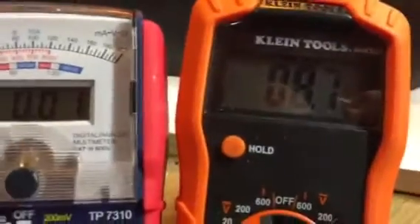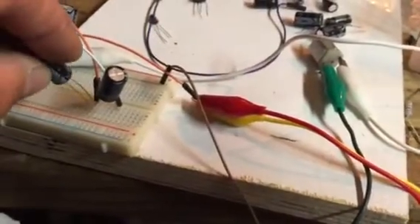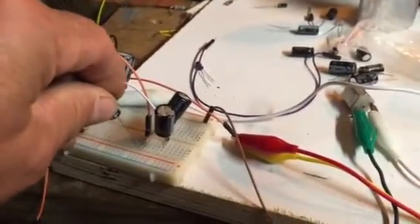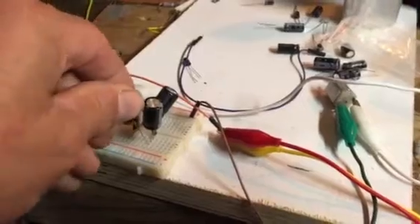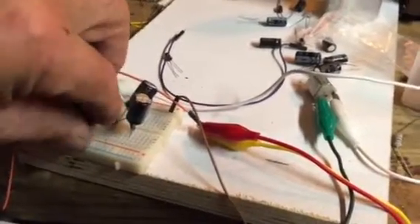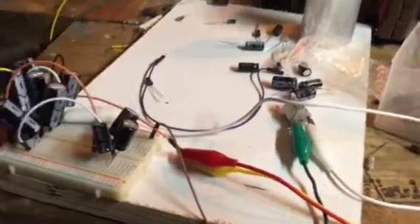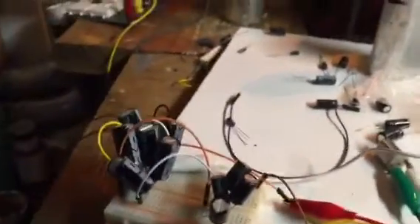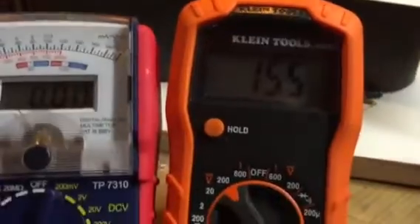You can see that the volts are not climbing as fast as they were because we're adding more capacitors. The next video we're going to use a transformer and step the voltage up — by doing that we'll probably learn that we get to increase the time it takes to charge and also get more running time. Let's add one more — that's a lot of capacitors — and it knocked us down to 15 and change volts.